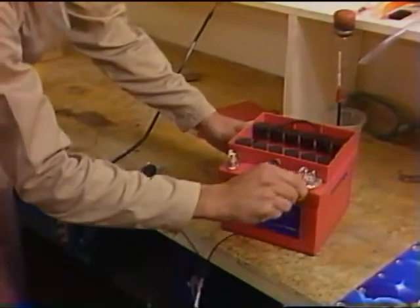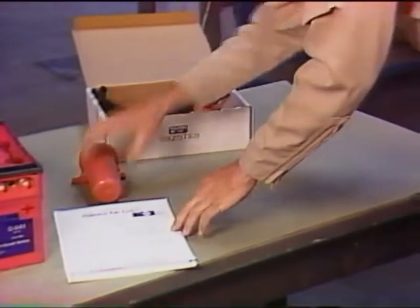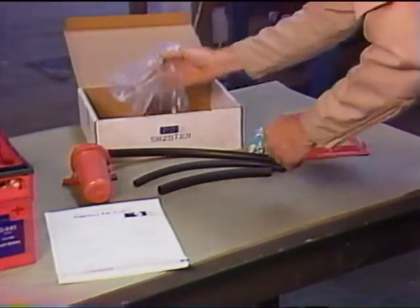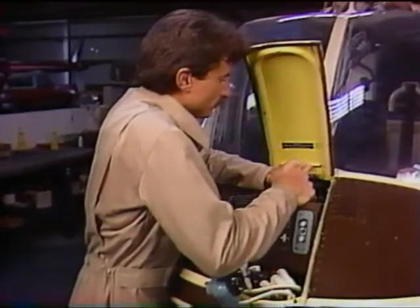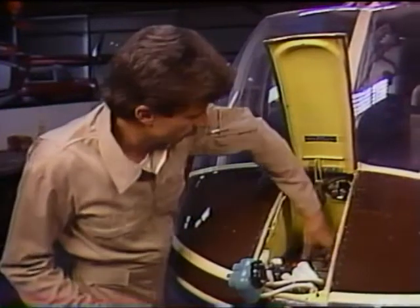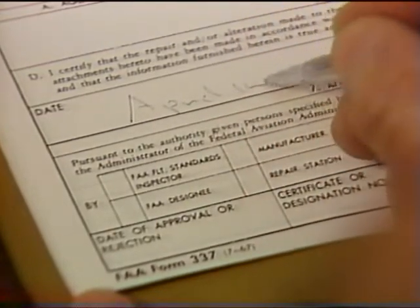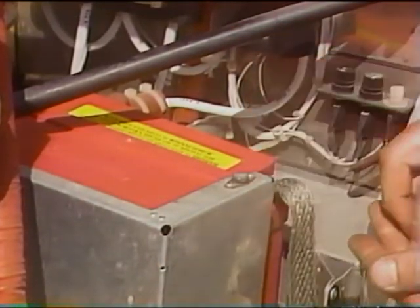Remember that the battery must be recharged following the test. Many turbine aircraft have been converted from NiCad to Gill lead-acid batteries. If you were to perform a conversion, ask your Gill distributor for the proper STC, which will include a kit containing the parts and accessories necessary for proper installation. The STC kit includes instructions for deactivating heat sensing or current monitoring equipment required for NiCad batteries, as this equipment is not necessary for lead-acid batteries. Teledyne has obtained STCs for most popular turbine-powered aircraft. If an STC has not been developed for the aircraft you're working on, perform installation using FAA field approval form 337, following the guidelines given in FAA advisory circular 43.13 covering lead-acid battery installations.